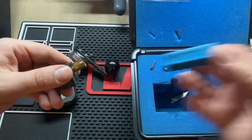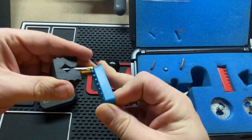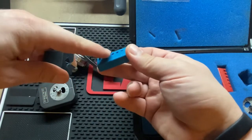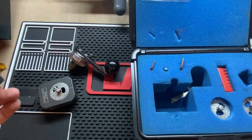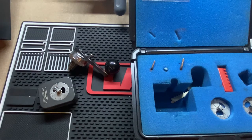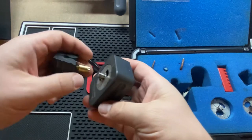We'll take our key gauge — I'm going to use this generation. Seven. These correspond to the pin values. I'm cutting a FeoK1. If anybody has looked into the FeoK1, this is not the bitting that is actually recorded with specifications, but because those depths are off by one, I have to cut them off by one because of how these machines originate keys. So, in case anybody researches that, that's why these are off by one.